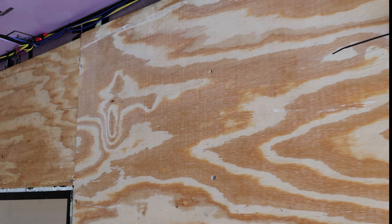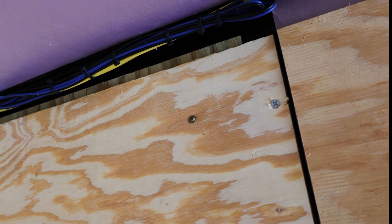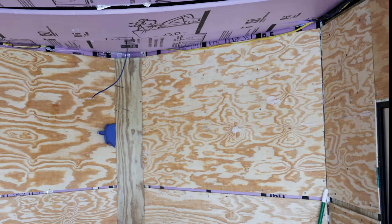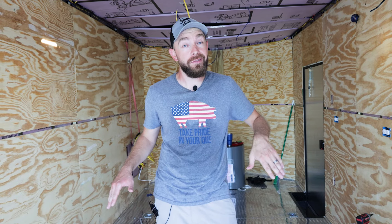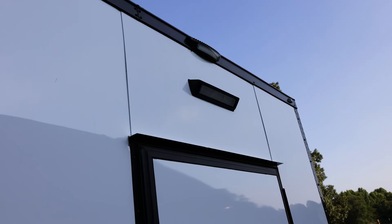If you look right above the door, you can see where I have all my exterior lights. Everything's tied on one circuit so all my exterior lights on the cooking side — where my awning is going to be — are all on one switch. Right up here at the very top, I have about 10 feet of wire coiled up so that when we get ready to put our awning on, I'll have plenty of wire already there for it. Looking down the center of the trailer ceiling, I have my 12-volt for my bathroom fan as well as several 12-volt lights throughout the entire trailer. On these hot days, I had to get the air conditioning wire ran too — we'll be putting that up in a later video. For the exterior lights, these are just simple 10-inch light bars I got from Amazon for exterior cargo trailers. They work for campers, really nice and super bright — I'm pleased with how they work. We got one halfway back and one right over the entry door, and then the factory light at the very top, which I went ahead and wired in.